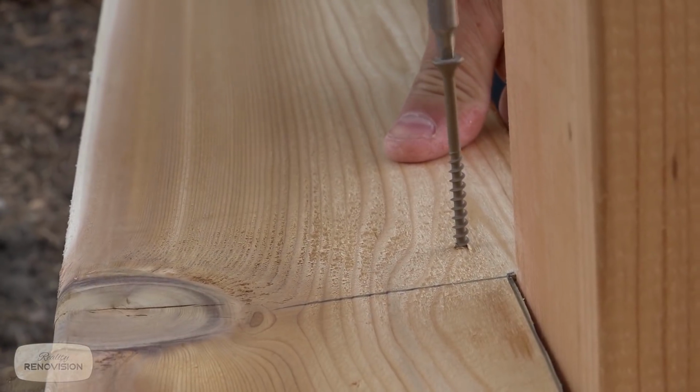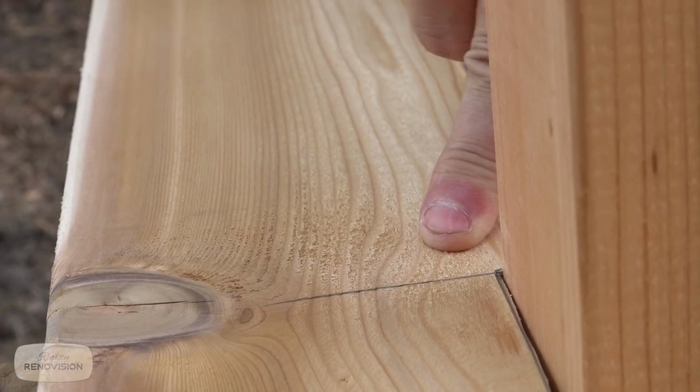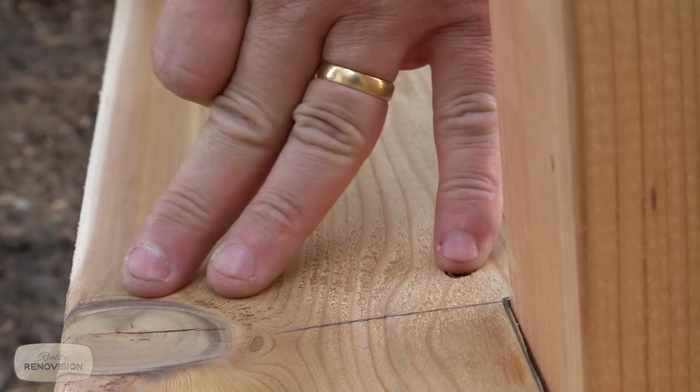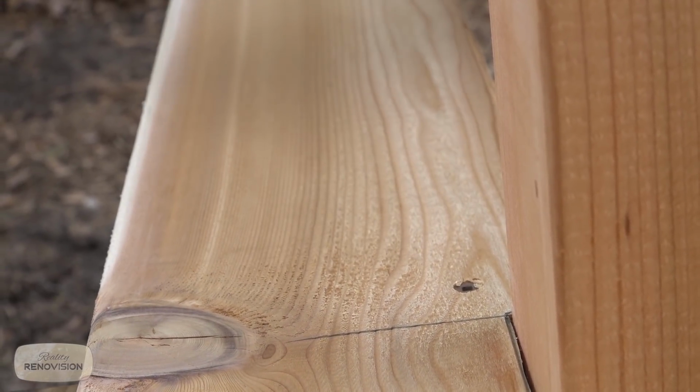Now here we go. You see that pull nice and tight? Now we're going to be using the saw later to cut off the edge. So it's better if all of your edges are screwed down first, because that'll save you a whole lot of time and you won't have to screw around with it afterwards and risk splitting your wood.